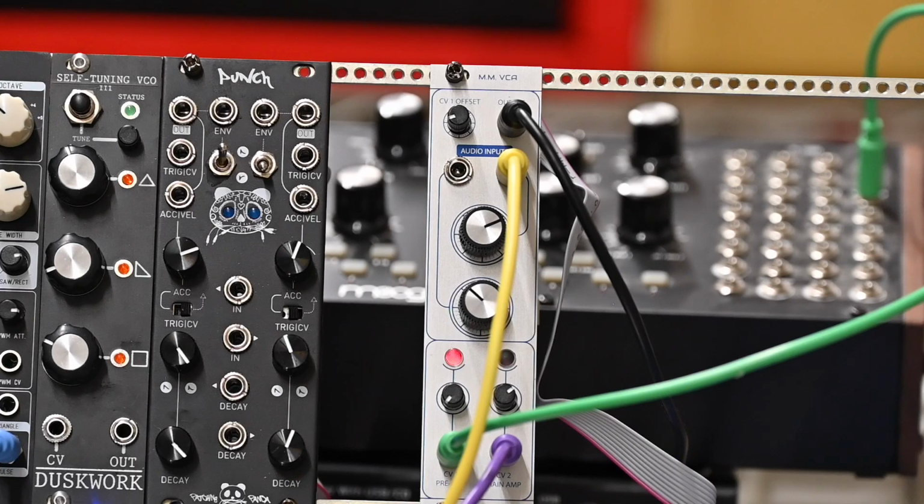So you can do a lot of stuff with it, as you can tell. It works fine as just a plain vanilla VCA, and then adding in the LFO, I mean, it's better than a plain vanilla VCA. It acts fine as a standard VCA with some clipping. Soft clipping, so it smooths out the edges, gives it a little fatness, and then adding an LFO signal can make a lot of, as you heard, grittiness and other things come out too.